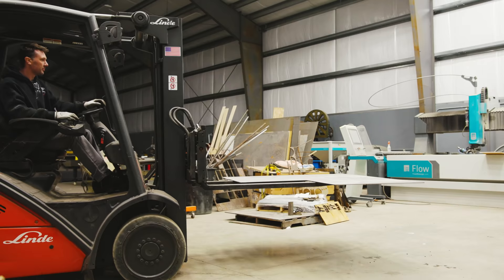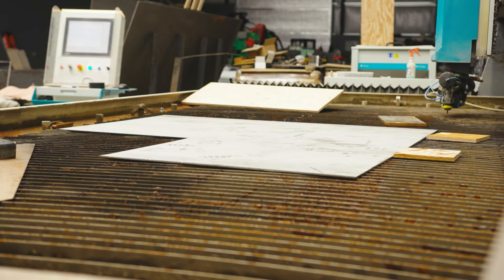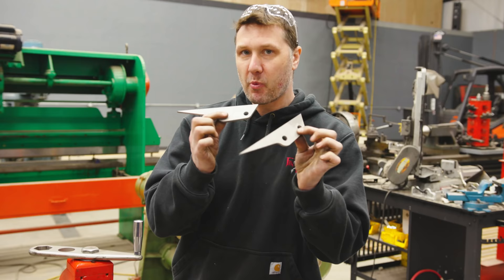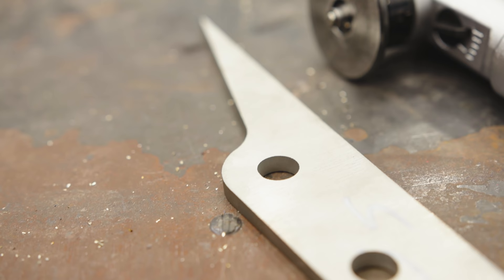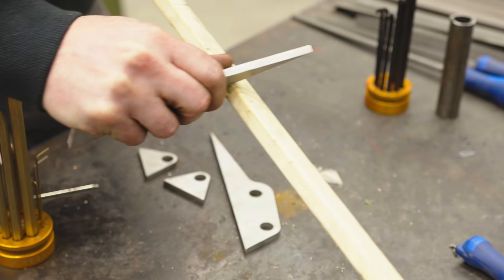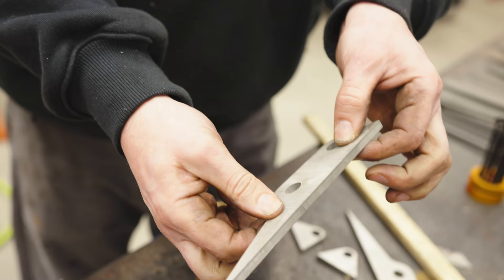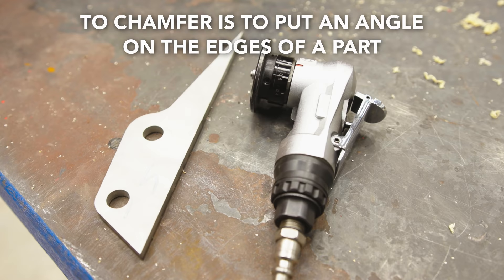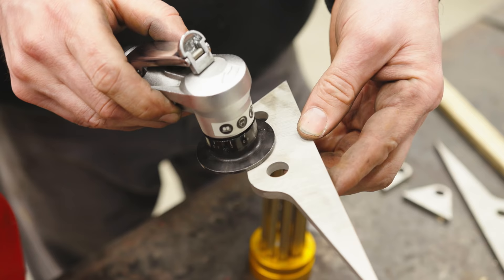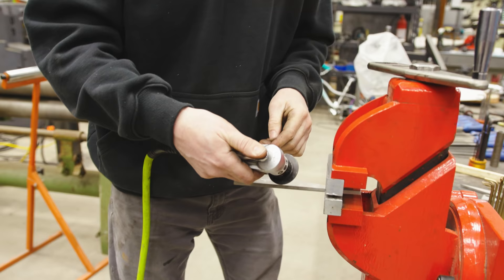For this project I'm choosing to use quarter inch stainless steel plate for all the tabs and brackets — hopefully this keeps the weight down while staying strong. The wheel brackets are all cut out on the water jet, but there's a huge problem: the water jet leaves a razor sharp edge. The solution is to chamfer every edge, even the inside of the holes, using a small tool with carbide inserts — basically a little router. I'll leave a link in the description below.